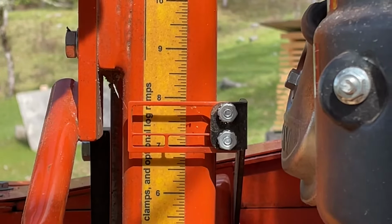The top of this one's just wide enough for a 1x6, but it has a crook on the far end. If we put a straight edge from this corner to this corner, if we make a 1x6 out of it, we're going to have a lot of wane right here. So we'll either have a 1x6 with some wane in it, or we'll have to turn it into a less desirable 1x4.